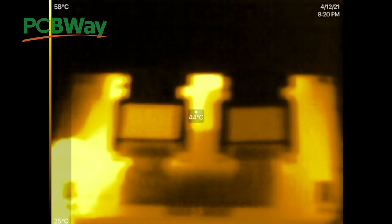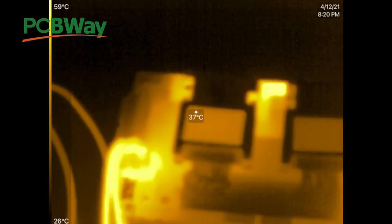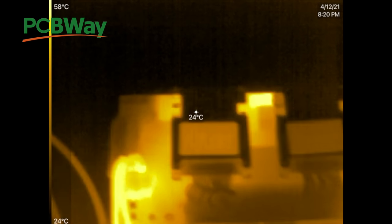Those cables right there are getting the hottest — 50°C. But even so, that's not really that hot. Getting closer with the thermal camera: the XT-90 connector is showing a hot spot on that trace, and that's where the bottleneck is. But at 50°C this is nothing — it's warm, not really hot. That's where the energy gets removed. Let's check out the cells themselves — they're basically doing nothing. The standoffs look cool too.